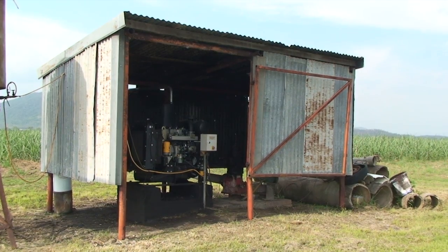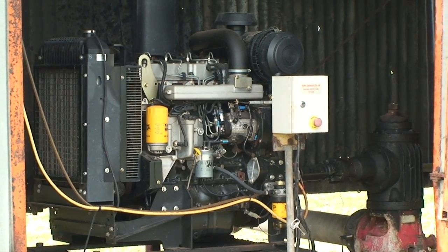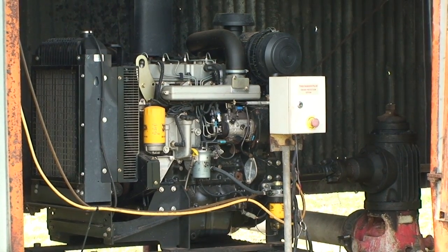Right power, right torque. The pump on the back there — the turbines are two to one head — so basically we run the pump at about 3,000, so we actually run this motor about 1,450 to 1,480 RPMs to get the desired pressure at the irrigator.